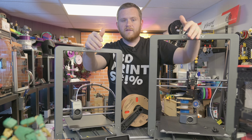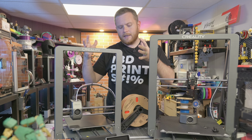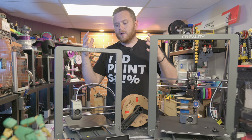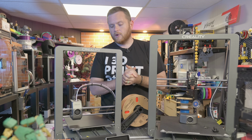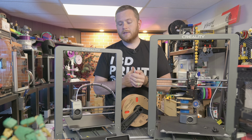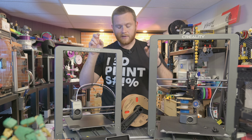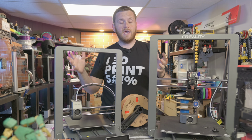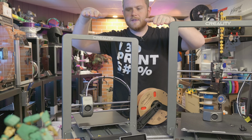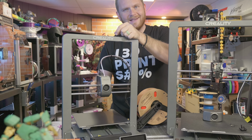They went away from V-wheels and extrusion-based machines and started making their own unique styling and design language, and obviously the Core XY technology that they adapted to those machines really boosted Creality machines and just quality in general, in my opinion. And what they did with the V3 here is they took all their knowledge with their bed slingers and adapted a lot from the K1 here. Obviously linear movement everywhere here, and they took the Core XY movement and kind of flipped it on its side. So now the Core XY turns to Core XZ.